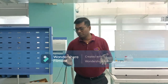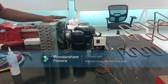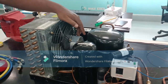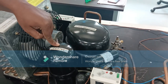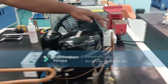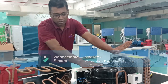This air-cooled condensing unit is not new to you. You can see this unit is provided with a condenser — this is the air-cooled condenser — and this is the fan and fan motor. Here you can see only the outdoor unit components: this is the compressor, this is the receiver, two capacitors are provided, and two protection devices — that is the high pressure switch and low pressure switch. Two service valves are also incorporated. This setup is made for performing the experiments.